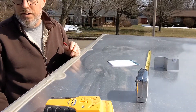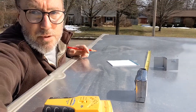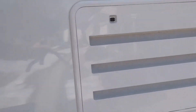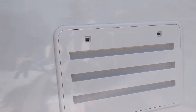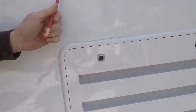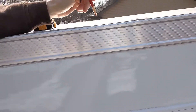I'm gonna put the panel on this side, and the reason I'm doing that is you can see — that is the vent for the refrigerator. What I want to do is pop the wires down that vent chase all the way down, and my electrical box is right next to that. So somewhere right above here in this location is where I'm gonna put the penetration and go straight down in.